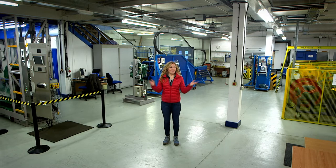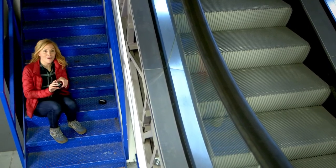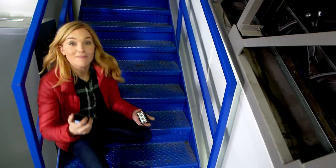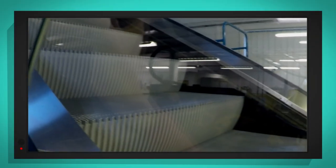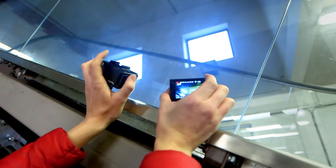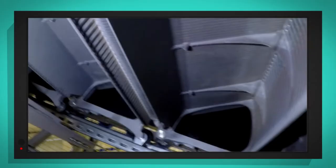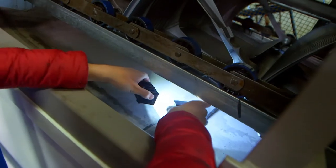Each step has small wheels on it. When a step reaches the top, the chain pulls the wheels around the gear until the step is flat again — it stays flat until it gets all the way back to the bottom, ready to go round again. This is an escalator workshop, and we've got special permission to be here so that we can see what the underneath of a real life working escalator looks like. I'm going to use my special camera and light to look underneath the escalator. Let's start by reminding ourselves what the steps actually look like — the curved bit is the side of the step and the flat bit is the top.